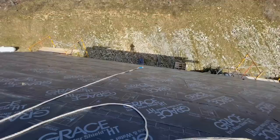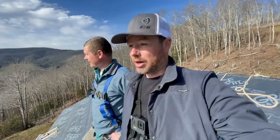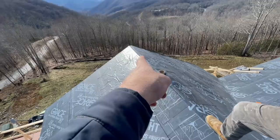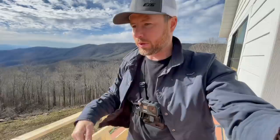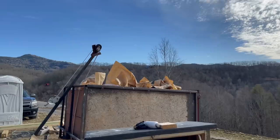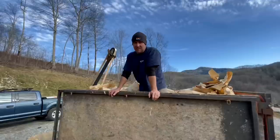That's it — we're sealed up here and we're going to put a standing seam metal roof on top of this. I would call that basically a lifetime roof, so the homeowner will never have to deal with roof problems again once this is done. Thanks to Grace — having this ice and water shield on the roof keeping this place dry is awesome. You'll notice we covered the ridges with the ice and water shield — those will get cut out when we do the vented ridge. For this lower porch roof, we're going to wait until we've got our final coat of paint on and take down the railing, then we'll do this roof, but we're putting the metal on the upper roof first.